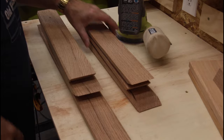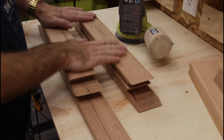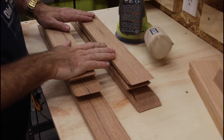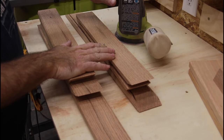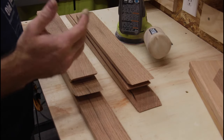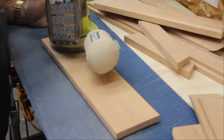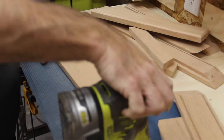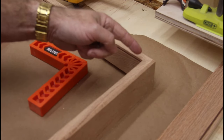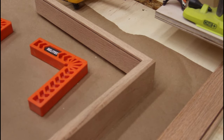So I'm at a point where we're almost ready for glue-up and I'm going to give everything a sand — definitely on the insides, but probably on all surfaces — starting with 120 and moving through 220. See how that feels and then we'll do our first glue-up. For the last step tonight, I'm going to go ahead and glue up the top miter so we get this V, and then we'll move on to the next step.